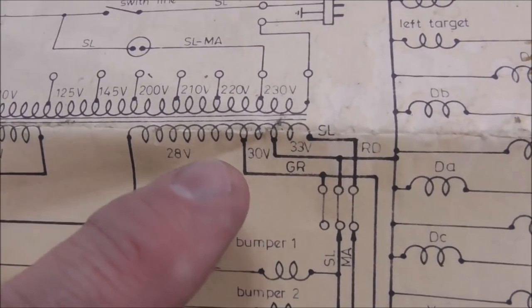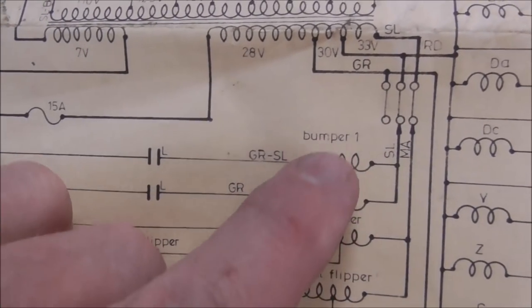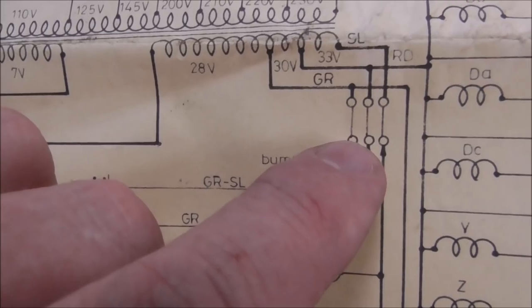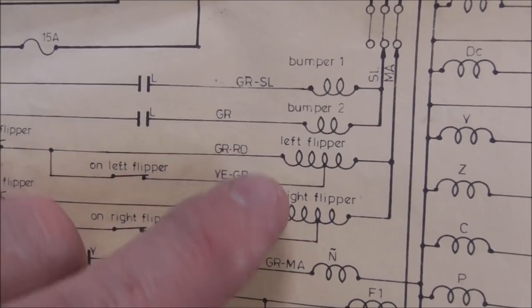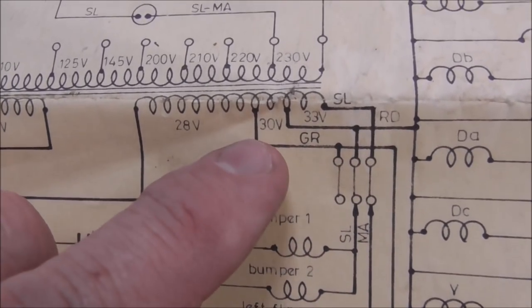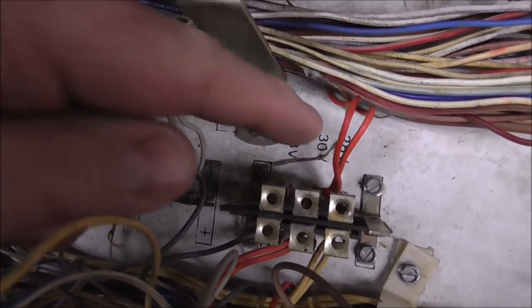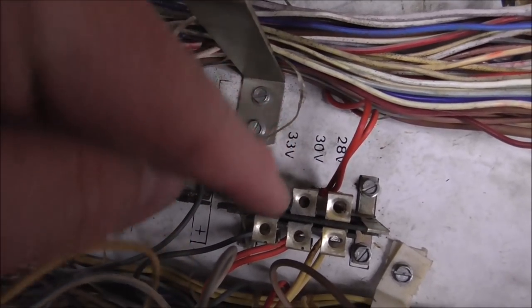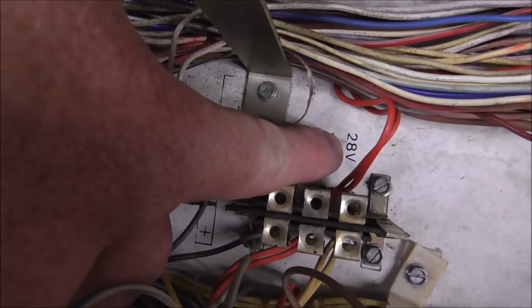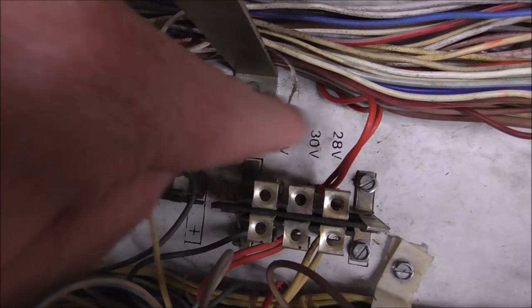Well, whatever, we'll see. But look how they have these little things here that they draw in. And then they draw the bumpers, like the thumper bumpers, the pop bumpers, with a slate wire that plugs in. See the little arrow that plugs in? And then they draw the flippers with a maroon wire that plugs in. And see the different voltages? When you plug the playfield in, there's a little jack where you can select the voltage that you plug the flippers and the pop bumpers into.